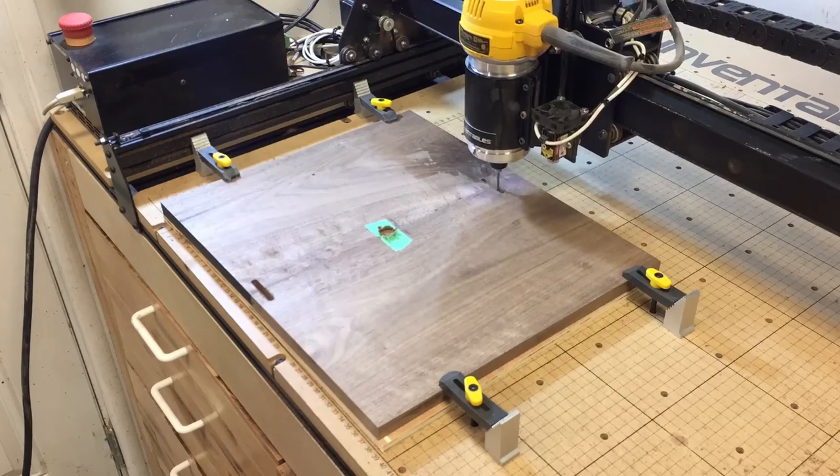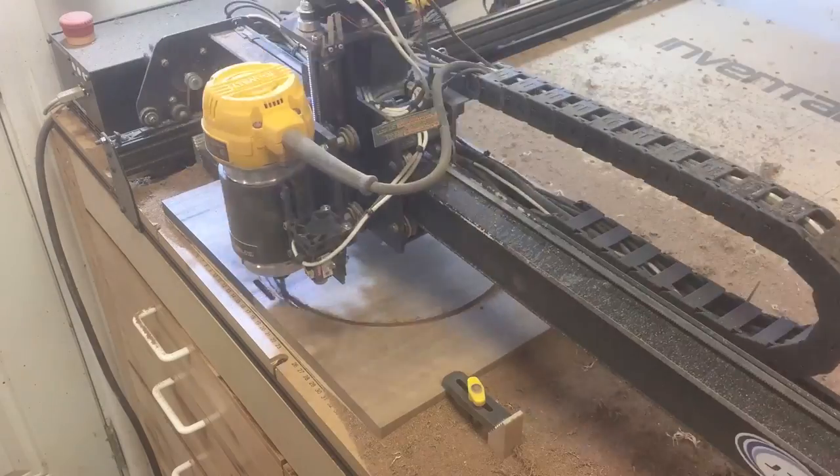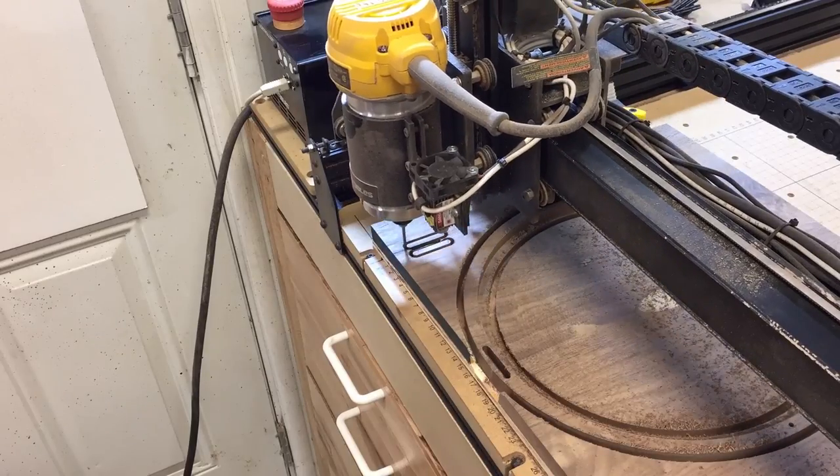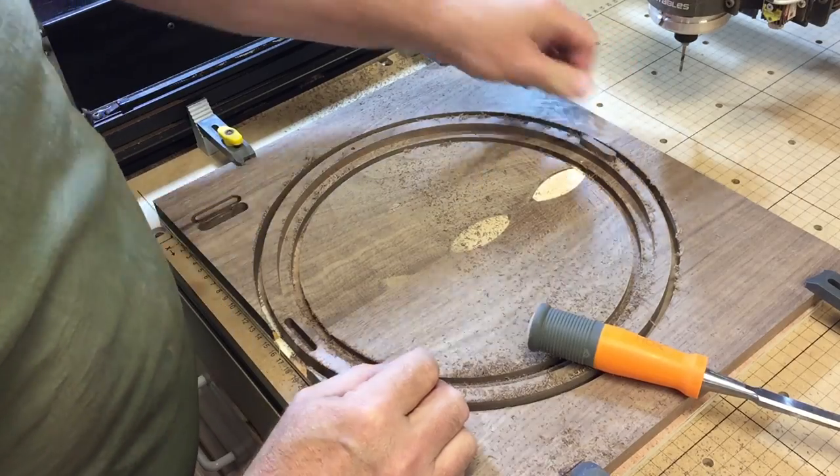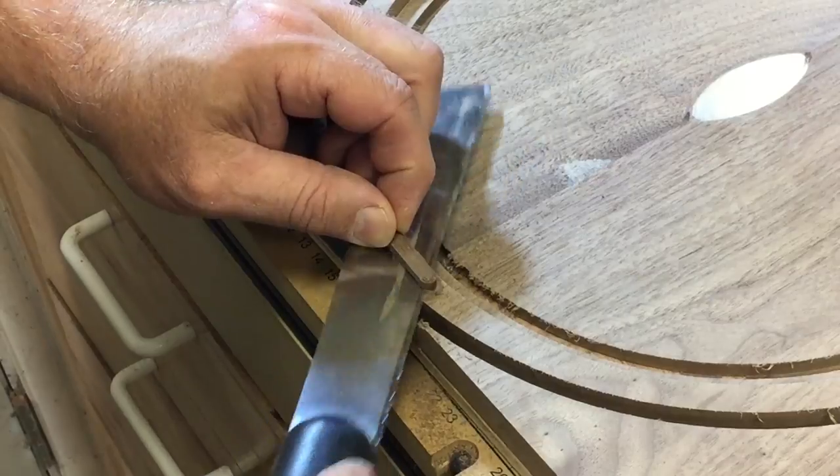Now to make the ring for the glass, I've jointed together two pieces of walnut. As you'll notice, on the outer part of the ring, there are no biscuits. So there's no mechanical joint holding it together, and it could break very easily. So what I've done is cut two slots on that joint and finish the rest of the cut, and then cut two pieces of wood to fit in that slot. And all I've done is glued them in, and it's now a strong mechanical joint.